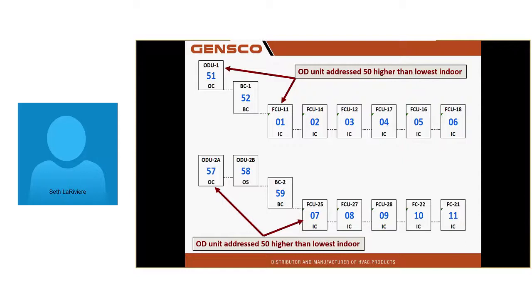A problem for you guys, not because of you guys, is that engineering might be working on a design, and they come up with a perfectly addressed system. And as this proposal goes along, which could take months, they say, oh, we want to change these 2 units, or we want to change that unit. And every time they go on the DSP and make changes, those new units get new addresses added. And by the time they finish and output that CAD diagram with all the addressing, you've got a system with address 1, 2, 37, 38, 48, because of all the changes made.